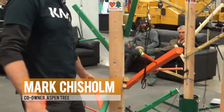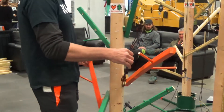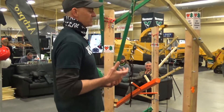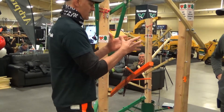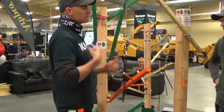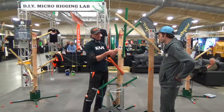For example, vertical picks — when you're just picking something straight up and down — it's the simplest, easiest way to go. But a lot of the trees that some of us have to deal with are really awkward in shape, and that becomes more challenging. If it's growing at an angle and you have two fixed-length slings, a lot of times people aren't making a mistake of where they put the crane hook. That's not the problem that causes a lot of movement or shock loading. The problem is the approach using the rigging and pairing it with the wrong cut.